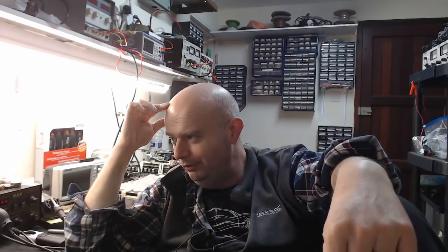For signal wiring, I would use twisted pair and screened if I can get away with it. Why didn't I use the Siemens motor that I had in the Panzer? Well, I had actually sold it, but even if I still had it, it wouldn't have worked too well for me because that motor was designed for a 360 volt system, whereas I've only got 192, let's say, in the E39, and I would have found myself limited. Now, it might have been okay, these things are hard to quantify. It might have been okay, but it might not.